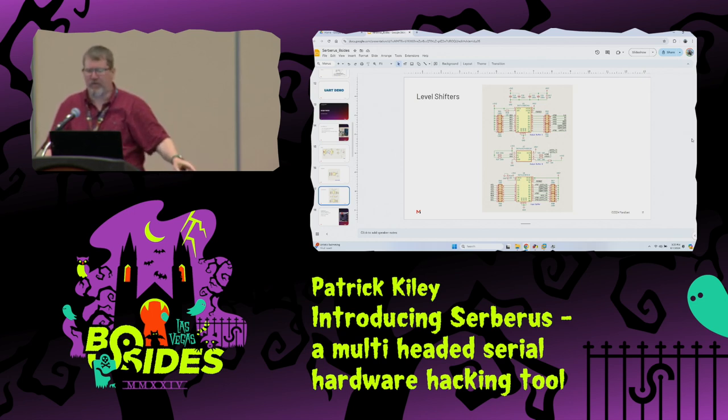There's also a fourth position on the switch where it'll actually run off of the voltage of your target. If you have something running at a really bizarre voltage, like 1.6 volts, 1.6 is the minimum of these level shifters, all the way up to 5.5, if the logic level is shifting that dramatically. And it will adapt the signal on the FTDI side down to the 3.3, or on the output side, it'll shift it up to the voltage level of your target.